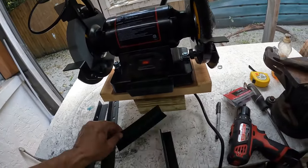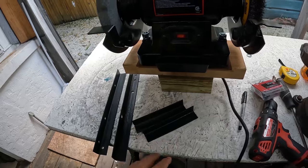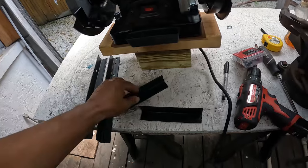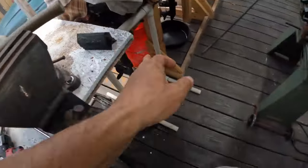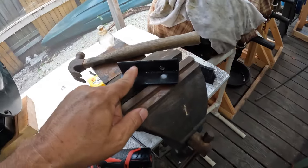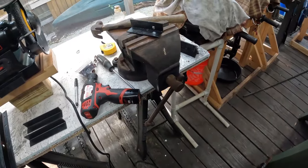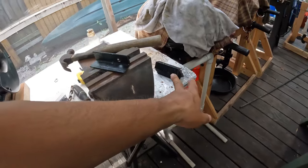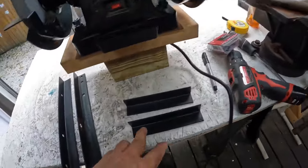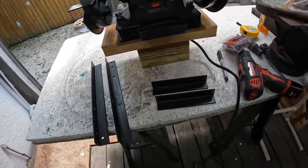But otherwise, I think I should work down up, but I want small victories to start with. So what I think I'm gonna do is I'm just gonna drill, baby drill. All these brackets need to have basically 4 holes each. Well, the bottom ones are just gonna be 2 bolts each because the one side is gonna be welded. So I'll just need another hole there. And then this is gonna be welded along the bottom. And, oh, okay, so all of my small ones are just gonna need 2 holes. So that makes it better. And then these are gonna be the brackets for this and this, they're gonna need 4. So yeah, time to get to drilling.